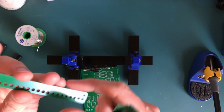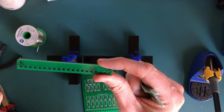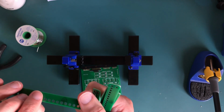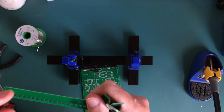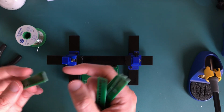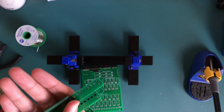So we're talking like each time, I think this is now exactly a 3mm hole, but I think actually the body of the LED is slightly less than 3mm, if I remember rightly. So they're still a little bit loose. But what I'll do is I'll put some masking tape over this, and that'll just help give it a bit of grip when it's going in. So I'll put some masking tape over there, start inserting the LEDs, get them bent so the legs will be right. And the idea basically then is, make sure I get the right one.